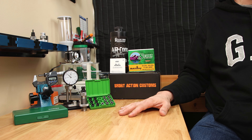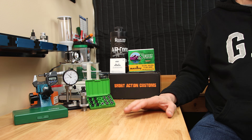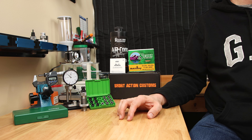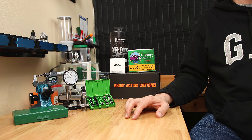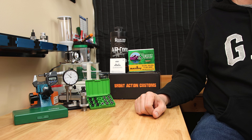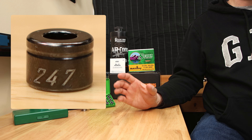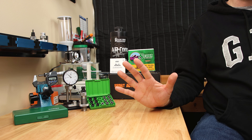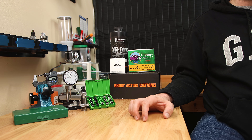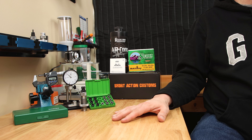The smallest diameter bushing you can get from either company at this point is a 0.243-inch diameter bushing. I plan to start at the smallest possible and test until I literally had no neck tension at all, and doing this is going to give us our first clue of how these bushings are different. The Redding bushing sizes I tested started at 0.243, and we stopped getting neck tension essentially after the 0.248 bushing — the 0.249 gave us no neck tension at all. Remember, our loaded round measured 0.247 inches and fired brass from this chamber is coming out at 0.253 inches. With the Short Action Customs bushings, we start at the same 0.243-inch bushing, but tested only out to 0.246 inches, since the 0.247 bushing was so loose I could change the cartridge overall length with my fingers. For today's test, we're only doing five samples at each value, and there are more options for Redding simply because there were more sizes that could be tested.